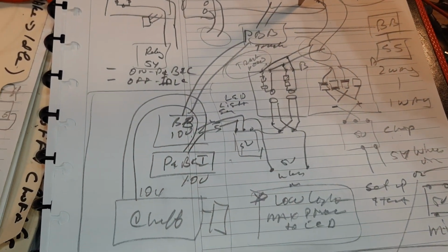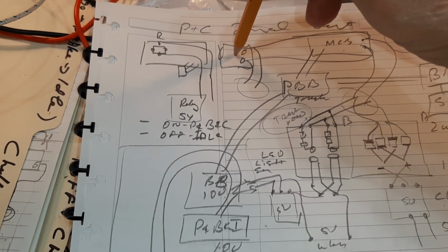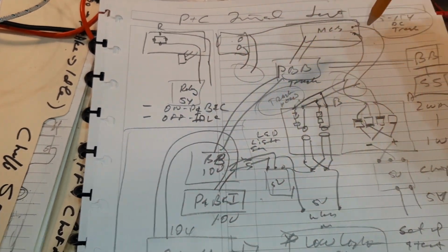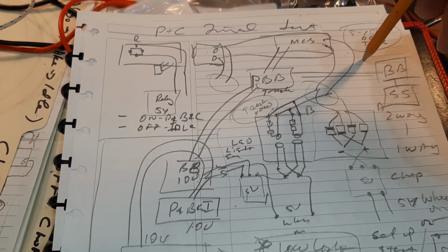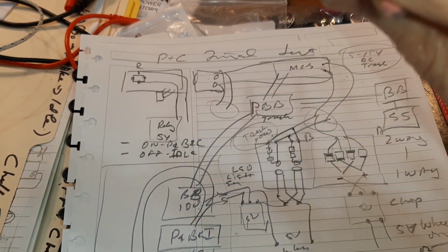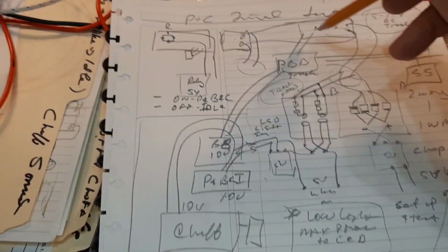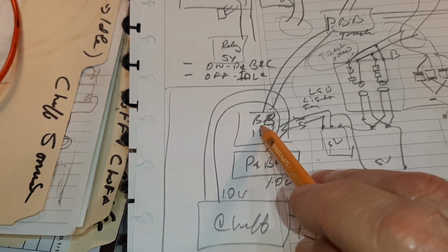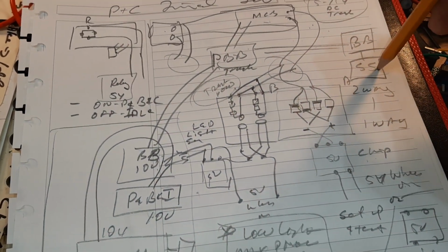start with a motor controller up here, and the motor controller runs the motor that runs the train, right? And I'm going to tap off of here for some motor sensors, whether it's going forward or reverse or it's off. Okay, those are the three modes: forward, reverse, off. There's a power distribution board that feeds that motor controller. That power distribution board also feeds a buck boost board, or can feed a buck boost board. It also feeds a second buck boost board, which is for smart smoke.